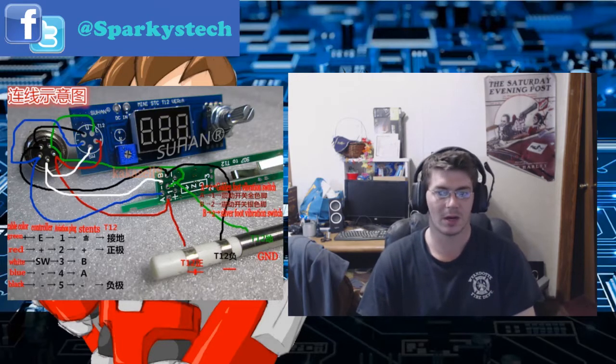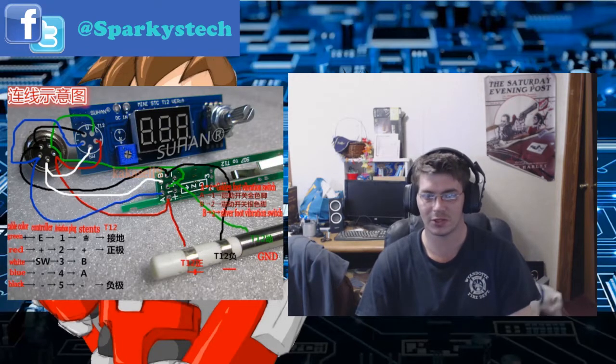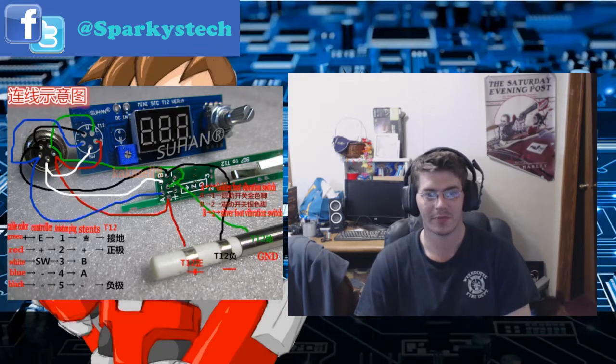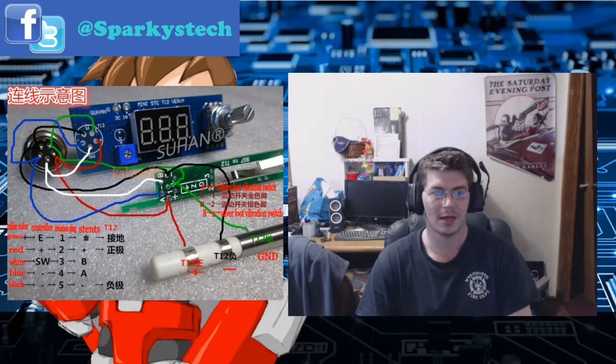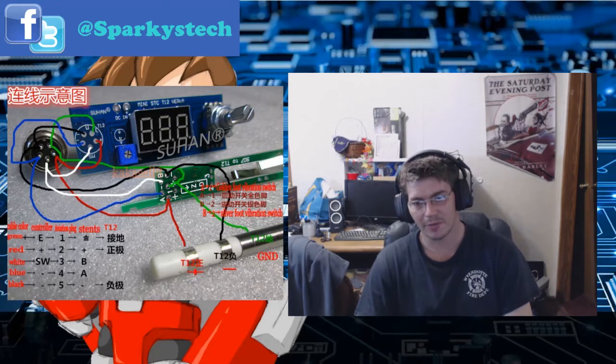Now, I understand why they have the horizontal switch on this. It's to tell the machine to turn the iron off whenever you're not in the solder position. Unfortunately, I think that's gotta be a nuisance for me, especially with this Hakko handle. So, I'm gonna go with my second plan of just jumping a negative with the SW.